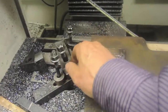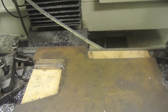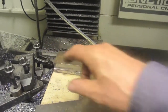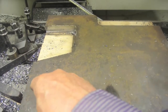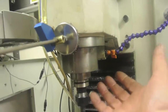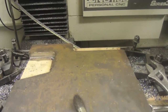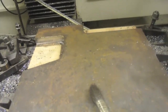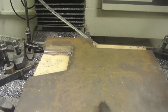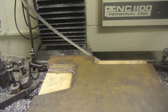There you see the first part of my profile cut. The plate is obviously too large for the machine to do in one cut, so I programmed these to be cut as slots and cut them out that way — a cut along here and so on. This then goes up underneath here as part of my gang tooling setup. I'm not sure how well it will work but I'm looking forward to giving it a try. It can't be any worse than the single tool which is supplied with the rapid turn.